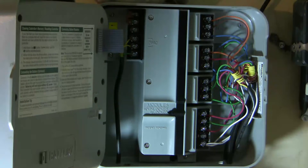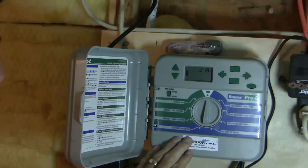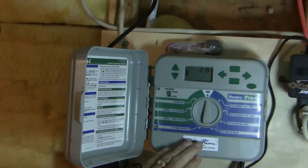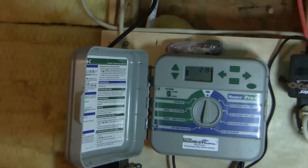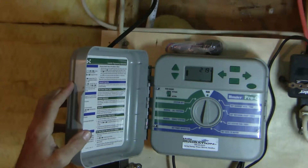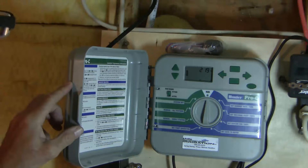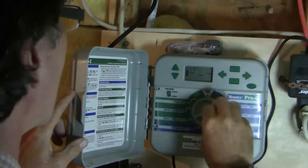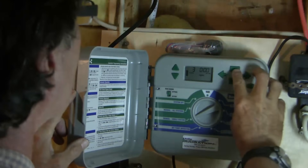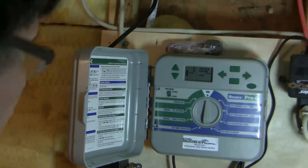My solenoid actually passed the screening test so I had to go further. If all of the other zones are working well, your next step is to see whether or not the controller is sending a signal to the solenoid to turn on. To do that you need to do a little bit of homework to know which zone you're dealing with — that takes a little bit of investigation. I know that the zone we're dealing with is zone 3, so I'm going to manually turn zone 3 on for a couple of minutes — and with this system, zone 3 is now on.